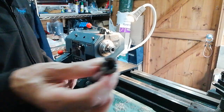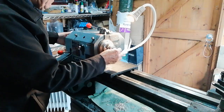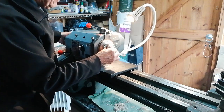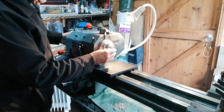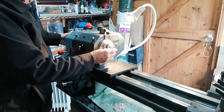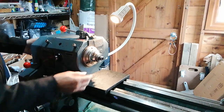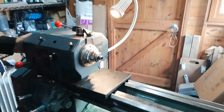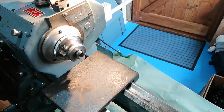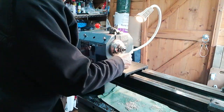Generally speaking, the round collets are much more useful. I have a full set of them and I've selected this half-inch one for you. You put it in and just turn it slightly — if it won't go in, give it a little twist and it seats. Then you turn the draw bar and you'll see it drawing the collet in, pulling it into the chuck. Give it just a touch more and it's seated.